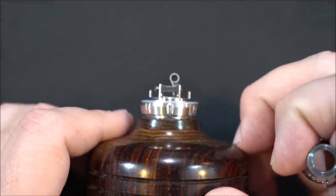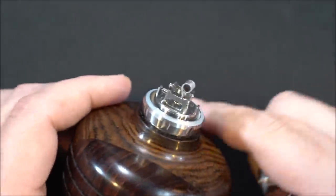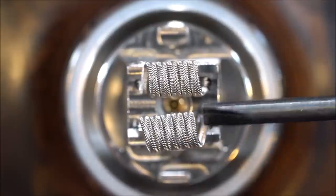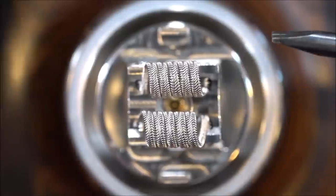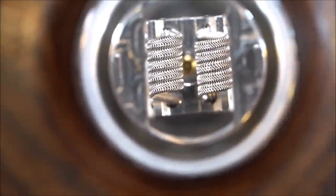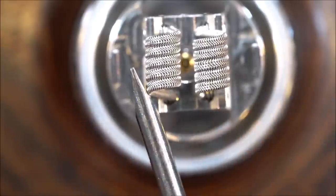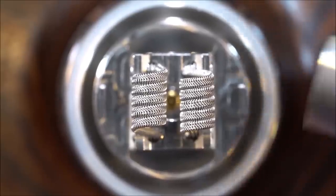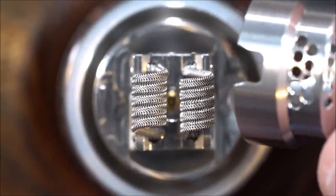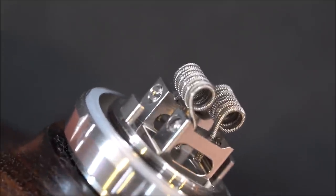Cutting at 4.5 millimeters you can see the lead just hanging down perfectly — you don't have to worry about it touching the bottom of the build deck. Here's a nice up-close look at the coils in the setup I want. You can see where they're overlapping just a little bit over the build deck on both sides — this is the perfect area to have the coils so the top piece doesn't touch anything or short out.